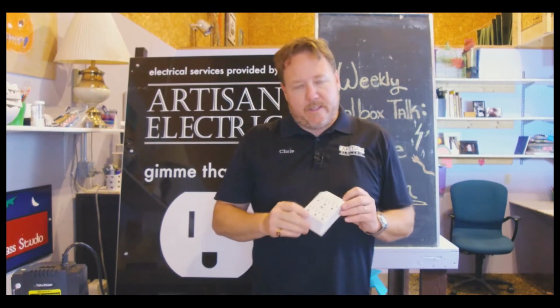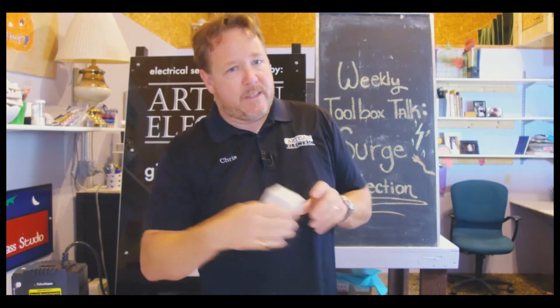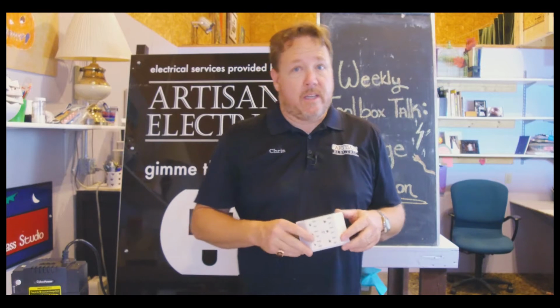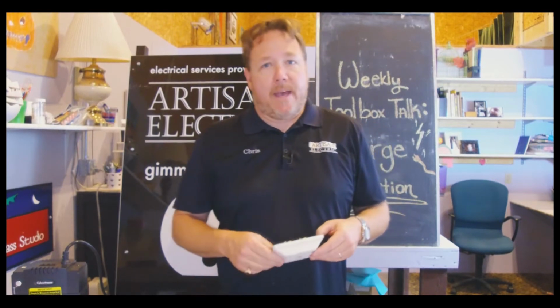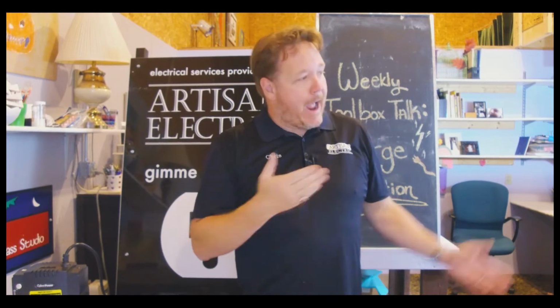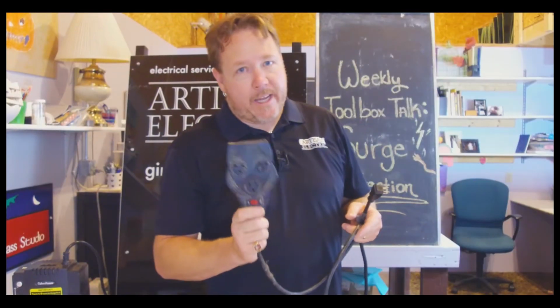They're junk. These are these little plastic multi-outlet assemblies. They plug into an existing outlet. Usually made out of plastic. This one has a cardboard back. Most of these are only rated for 6 or 8 amps. We see a meltdown all the time, especially if you're using space heaters or high capacity loads. So what we do with these, we get rid of them. Out.